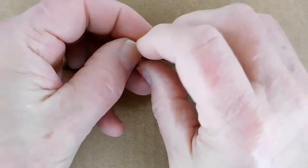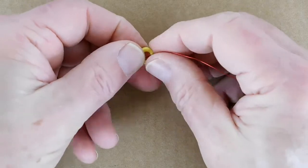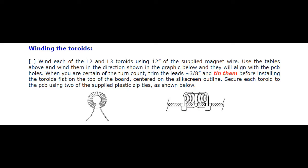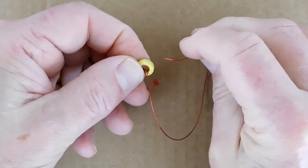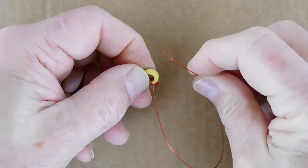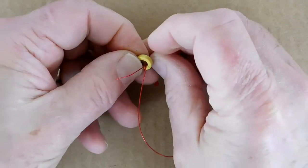Let me show you the right way. Watch carefully. Notice that the direction of the winding is specified and is shown in the drawing. Watch as I finish the winding process. See how each turn starts by coming through the bottom of the toroid, exits out the top, goes to the right, and back in through the bottom. You southpaws will have to adjust the instructions to suit yourselves, but the final product should be the same regardless of which hand you use.